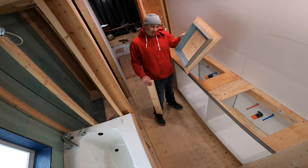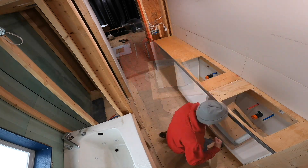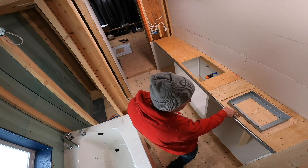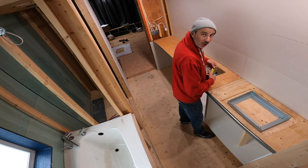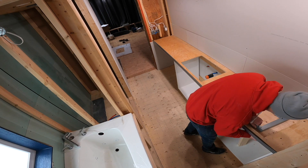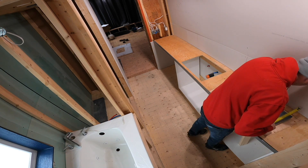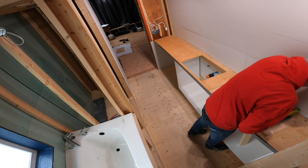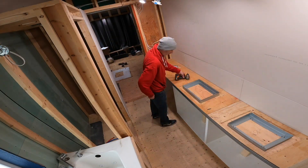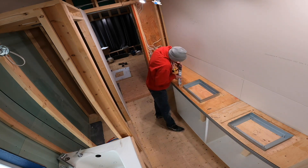I've got sink underside form two and a dead man I'm going to use to prop under it so I can keep it still while I line it up perfectly. I'm right on my center line and I'm looking for four and a half inches off the drywall to know I'm at the right spot. Once I'm happy with both form positions, I'll use some silicone just to seal the little crack that'll be around the plywood joint.